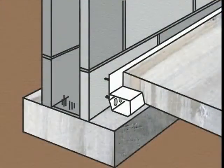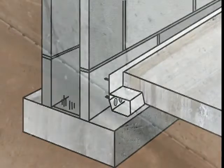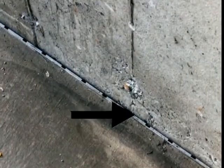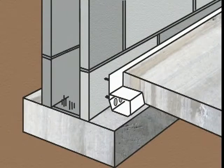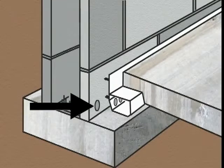The patented WaterGuard system has a design that separates it from the soil under your floor so it will never clog. It also has a special wall flange that creates a neat space between the floor and the wall to drain any wall seepage without allowing dirt and debris from the floor to enter. The system is applicable to all types of foundations, including block, poured concrete, stone, etc. Weep holes are drilled into block walls to drain water out of the walls into the system.